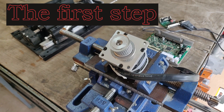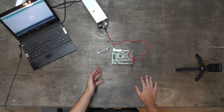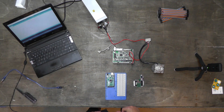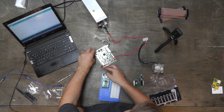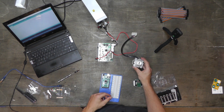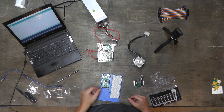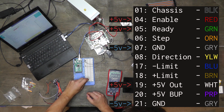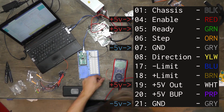Controlling these motors is just the first step. So we're going to be playing with some Arduinos — I'm reverse engineering this motor control. The challenge today is to take this servo motor so that I can start characterizing it on this servo drive board. At this point I'm just feeding 5 volts into the development board from the Arduino, and then I jumper 5 volts into the ready and enable pins.